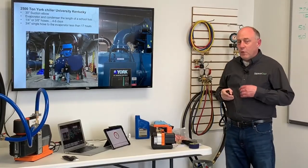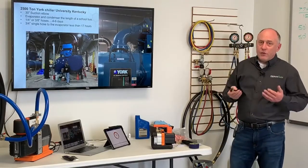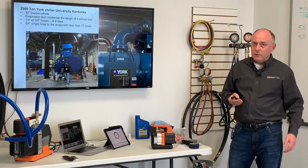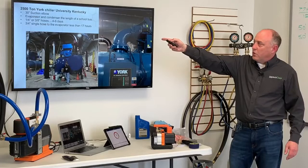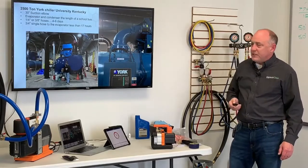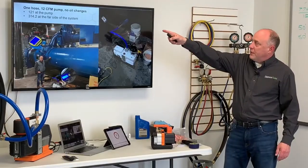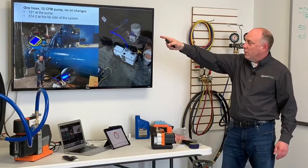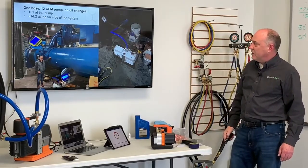Typically, they would take 4 to 6 days to perform this evacuation. We started this at 4:30 in the evening, and we came back the next day. We thought we'd be down, so far we didn't have any idea. But we did that with a single 3/4 inch hose in about 17 hours. And how far down did we get? Well, one hose, 12 CFM at the pump, no oil changes. We literally started overnight. 121 microns at the pump, 314 microns at the far side of the system on there.